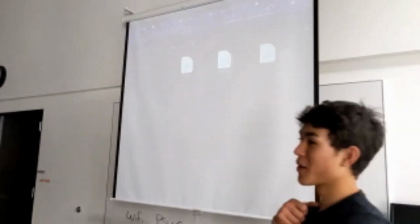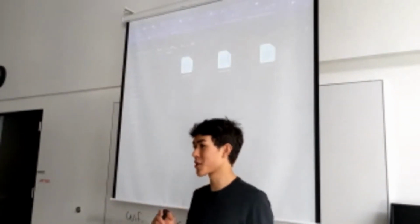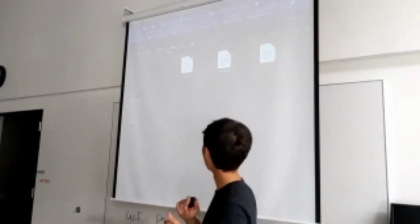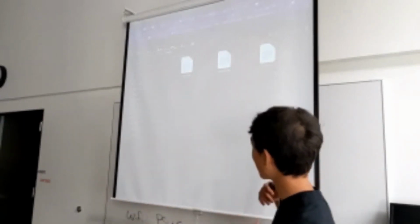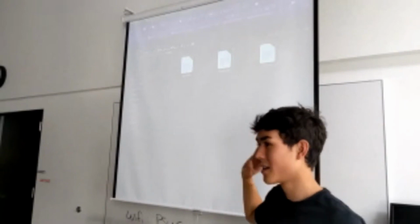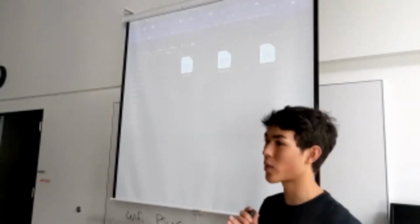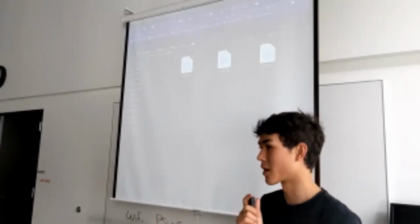So one thing to note, be gentle, but I develop all the firmware by myself. If you encounter any bugs, I'd first off like to hear about them. But one of them that you should know about: working with a USB mass storage class device, or writing the firmware for that, is a pain in the ass. There's one bug where if you copy and paste a text file, this can actually cause some issues on the file system. So I'd recommend just creating a new text file instead of doing Control-C, Control-V for an existing payload. Just be aware of that.